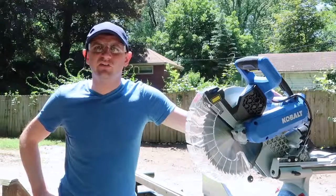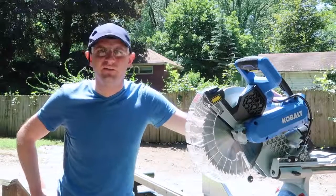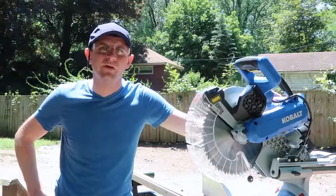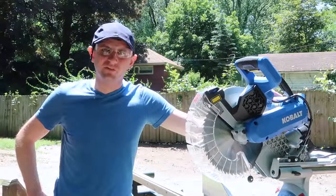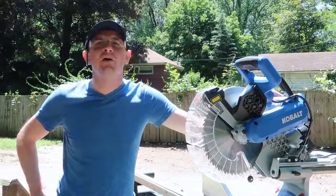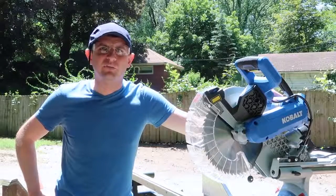Shelves to appear 2 inches thick, but to purchase a 2-inch thick slab of wood is very costly. So the way we're going to get around that is we're going to build a ladder frame out of 2x2s that'll support the structure, and then we'll skin that frame with finished grade plywood so it'll end up looking really nice and attractive.